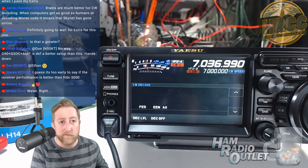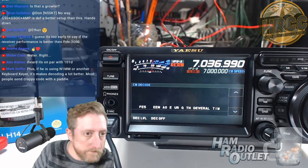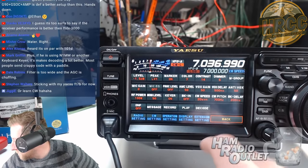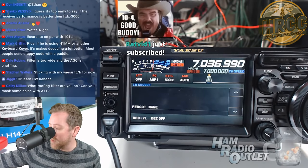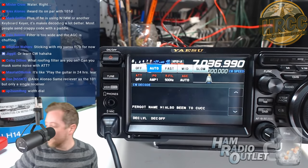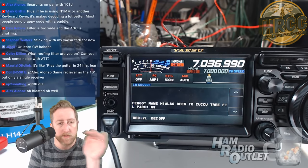So you've got to be kind of Johnny on the spot with the speed. Filter is too wide and the AGC is chuffing. That's true. Let me go back here for a second. Let me expand that. Go back to decode. The roofing filter's at 500. I had it at 400 before, which will probably help it out. And AGC is auto. We can make it fast if you want, but when you go to expand it or not expand it, it pops up those four buttons there at the top below the zero beat and the meter.